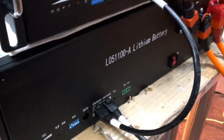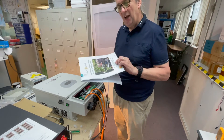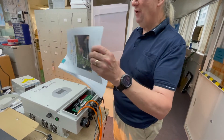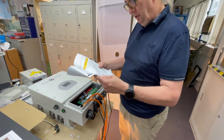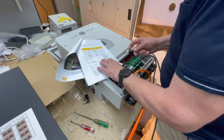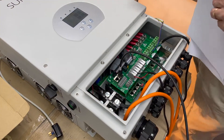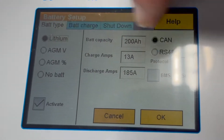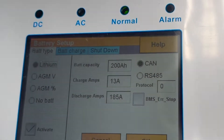If you go into the manual — this is the inverter manual, so always keep your manuals handy — it all has the same information. Go through the manual, look at the type of battery, and it will tell you. I'm looking for CAN: zero, CAN, and zero. So I plug this into the CAN port here, and it will go into the CAN. I go onto the screen here, go onto battery setting, lithium, and you see CAN and it's zero. That corresponds exactly to the manual.